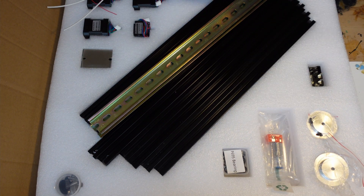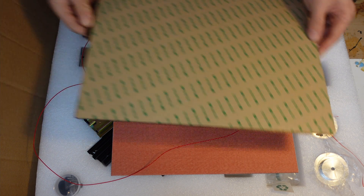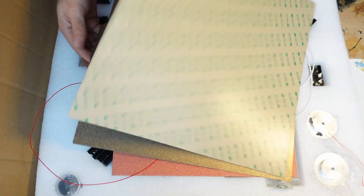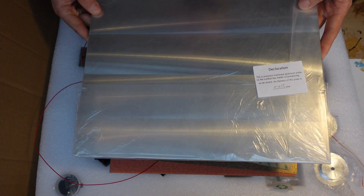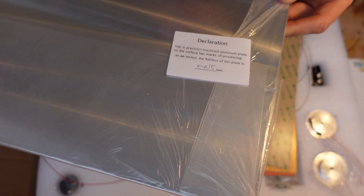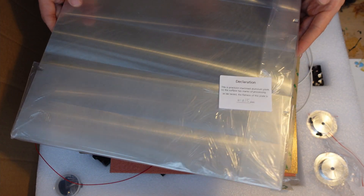Underneath the first layer of packaging you will find a silicone heater with all the wires, a powder-coated magnetic build plate which is a bit bigger than the aluminium plate, and a heavy and thick aluminium bed. A little remark about the surface quality: it should be zero to 0.15 millimeters precise, which is pretty much acceptable for a bed of this size.